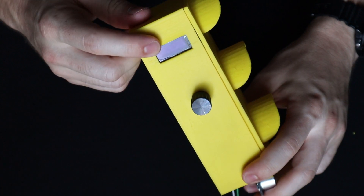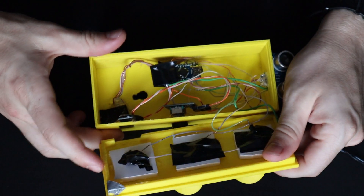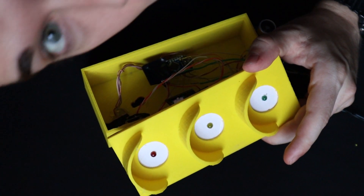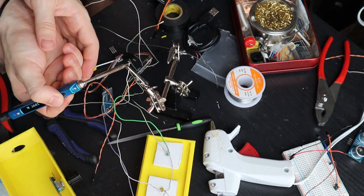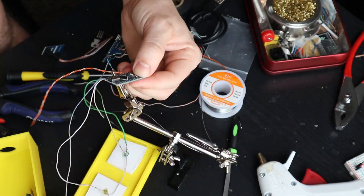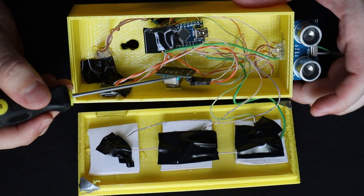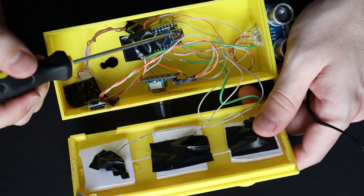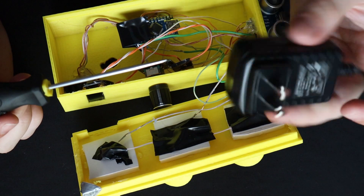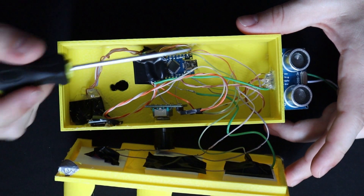On this side you have the rotary encoder and the OLED display, but on the other side you have literally nothing. Now brace yourselves — I'm going to show you the inner workings. I did a few more modifications with the pliers just to get it to fit, but it's a prototype. The wires I got from an old CAT5 cable were not the best to use — they're solid core, so they're not very friendly and everything is kind of springy. I put a resistor for all the LEDs on the board; they share a common ground, and the positive leg of the LEDs go to the corresponding digital pins. For power, I'm using a basic 5V 2A transformer.